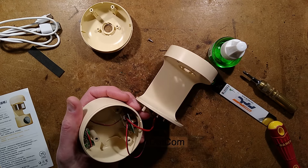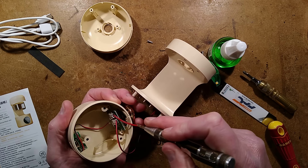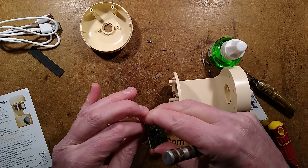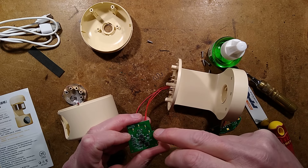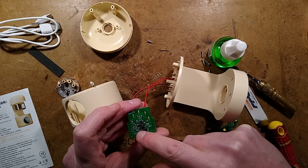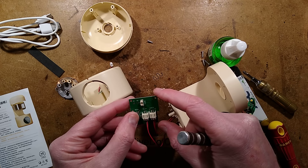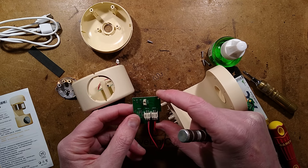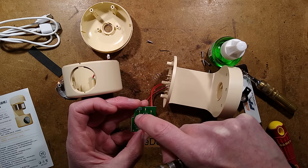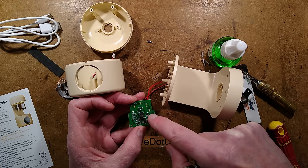The two red wires are the heater. It's an interesting subject - the pyrethrins - and it is very small quantities. I have checked if other brands fit in here. I can slide the circuit board out to reveal a little eight-pin chip. Going by the number of LEDs, I bet it's just using six pins of the chip - the heater drive pin will be via transistor. There are lots of other chip positions. Does this have the facility to be rechargeable if another connector is added? There's another transistor used to switch lights, a power LED, probably a charging circuitry LED, and the other three LEDs will possibly have their own drive pin.